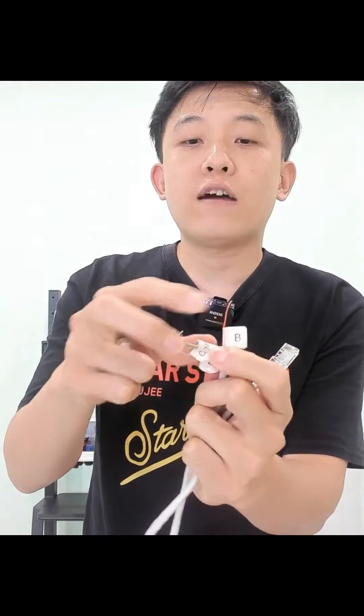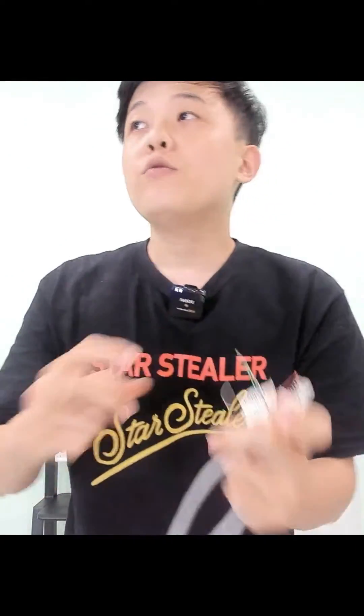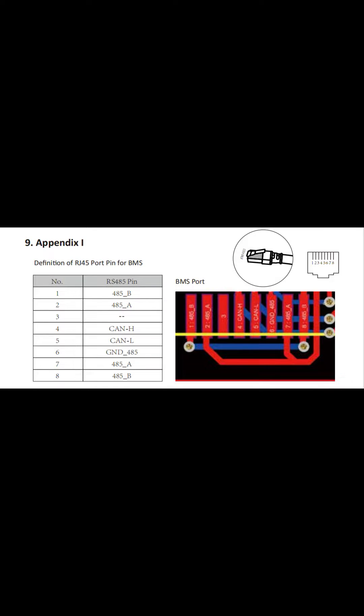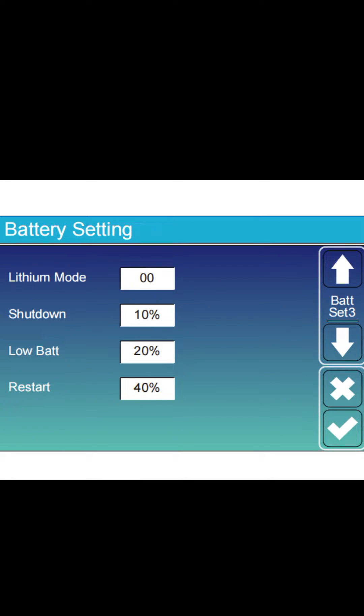You can see there are four bare wires on the other side: RS-485A, RS-485B, CAN-L, and CAN-H. We have also made an RJ45 connector to the inverter according to the pin definition of the communication port. For the Deye inverter, the pin definition is pin 4 as CAN-H and pin 5 as CAN-L, and the protocol is set to BMS CAN. We have already made that connector.